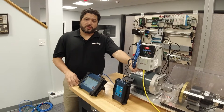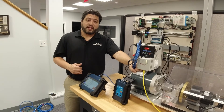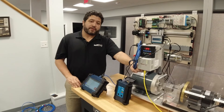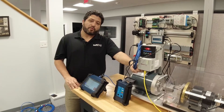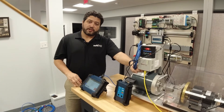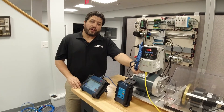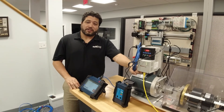What you should do as a user in this situation is obviously substitute this cable for another cable and repeat the BERT test or the full cable qualification test with the XG. If it pulls zero errors, you should be confident that it will succeed in the application. Keep in mind that other testers — basic testers — do not perform this BERT test, and simple wire map tests of the cable will not tell you if there are issues such as those shown by the NetExpert XG.